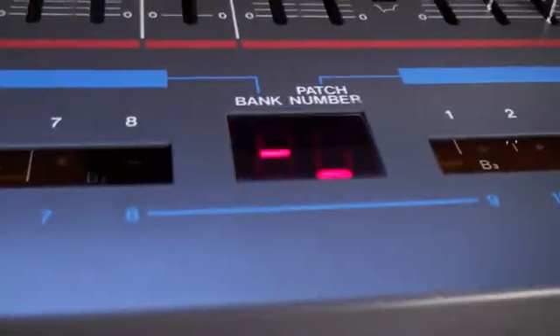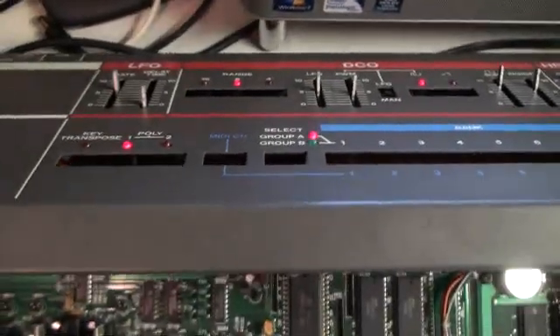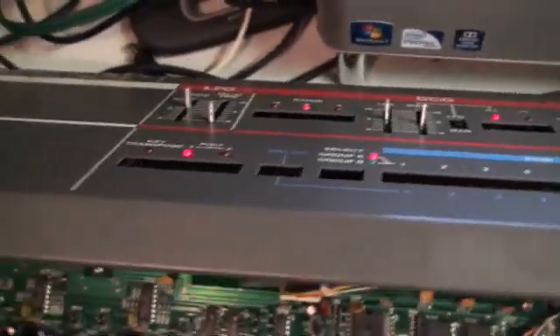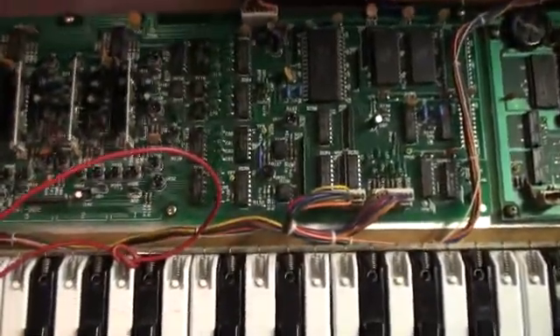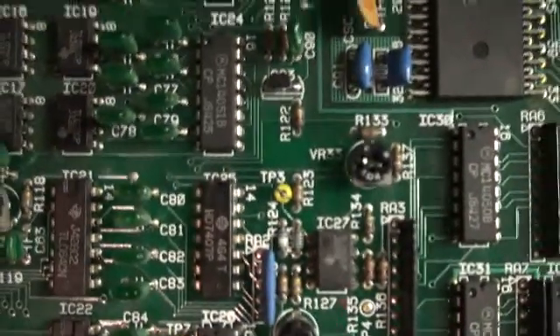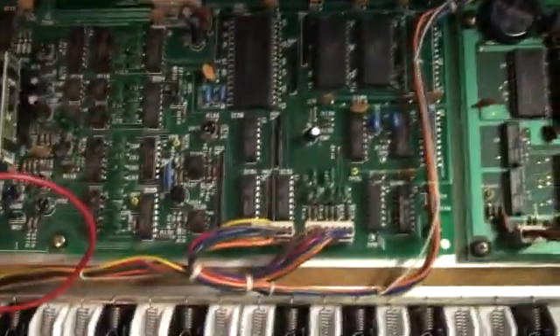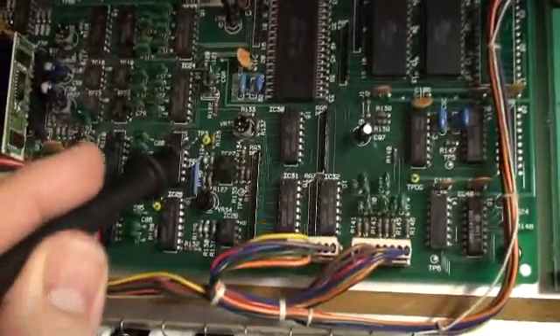The important thing I didn't do yet is press the MIDI channel button. By pressing the MIDI channel button — and I would remind you I have these keycaps out because I'm going to be retrofitting them, that's the reason why they're not in there — test point 3 is what we want to check and we want to adjust VR33. So here is test point 3, and here is VR33 right next to it. It's sort of in the shadow there. I've got my little probe and I'm going to touch test point 3.